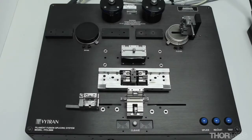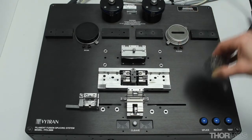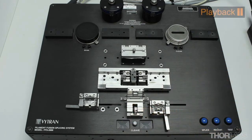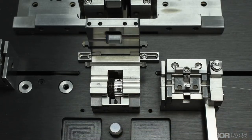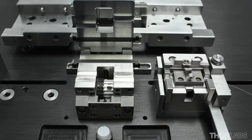Remove the fiber from the ultrasonic container at the cleaning station and visually inspect it to ensure the glass is clean and free from debris. Now move the fiber from the cleaning station to the cleave station. Ensure that the fiber holding block's fiber cleave lever is facing forwards. When the fiber holding block is placed at the cleave station, it will activate a vacuum that will help to locate the fiber into the cleave insert's V-groove. If required, a finger can be used to manually guide the fiber into position.